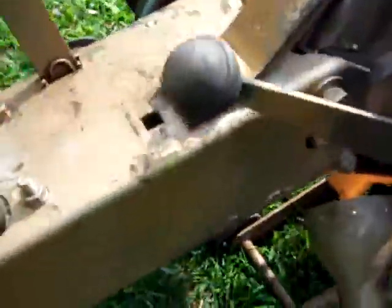I'm going to go underneath the tractor and do this the best I can — bear with me, I hope this comes out. Got a spotlight under here. See the cable right here? It runs through this nut — it's like a carriage bolt. You got a nut on the other side; you loosen that nut up and you can pull the cable through. Pull your cable through and make it as tight as you can. Then on that rod up top, you run the bottom nut up for the final adjustment to keep it there.